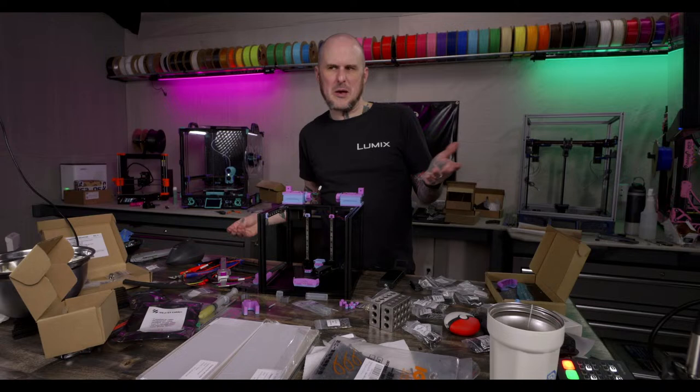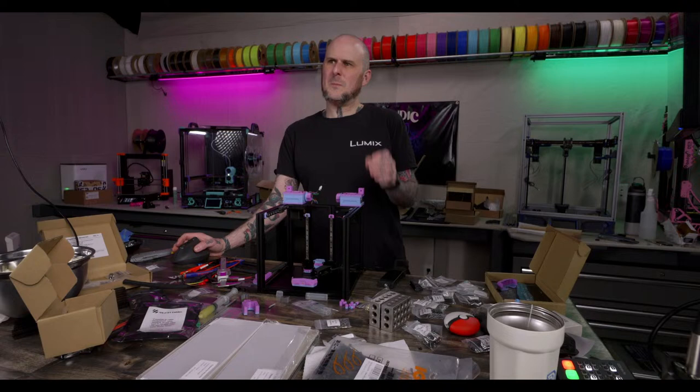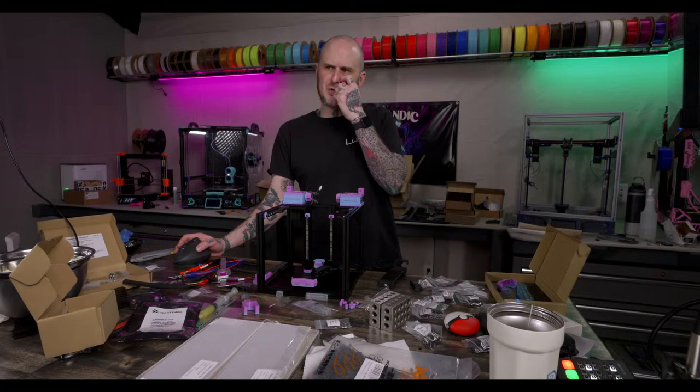Partial to the Rapido. Yeah, we were talking about that earlier, Norton. That's kind of my go-to recommendation for a hot end right now, the Rapido with a CHT nozzle. Biney, hello! Higher wattage are usually only good for higher temp stuff, like ABS with high flow rate.